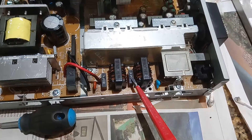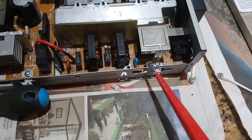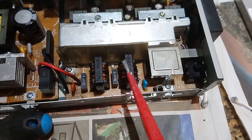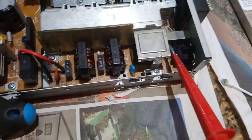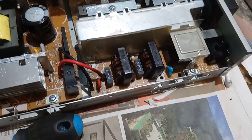The capacitance was a fifth of what it should be. There's also a further capacitor underneath here, so all three have now been changed. The fuse, which is in this area, had also blown. Let's put it back together and see if it works now.